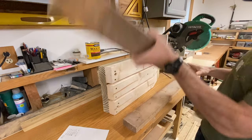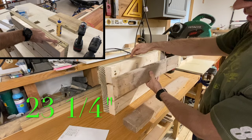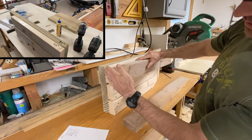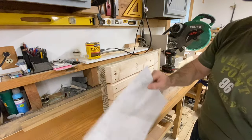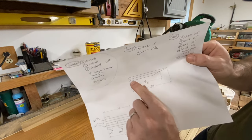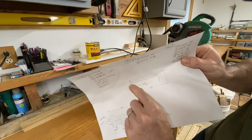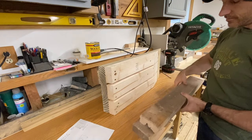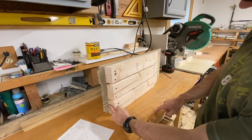Take all of them apart, and you'll mount these boards onto your 2x12 before you cut this angle. You line up all them ends. Line them all up flush. This is like a side view of it. It'll be lined up like that. That dotted line is showing the piece that you will cut out. That'll be your last cut. All right, so you got them all glued and screwed on there before you cut this angle.